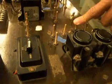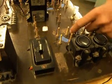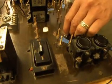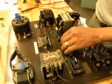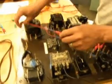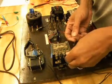From the other terminal of my normally closed stop button, I'm going to go to the normally open contact of my start button. Also from this normally closed stop button, I'm going to go to the middle contact of my selector switch. From what I'm going to use as the run portion of my selector switch, I'm going to another normally open holding contact on my relay.